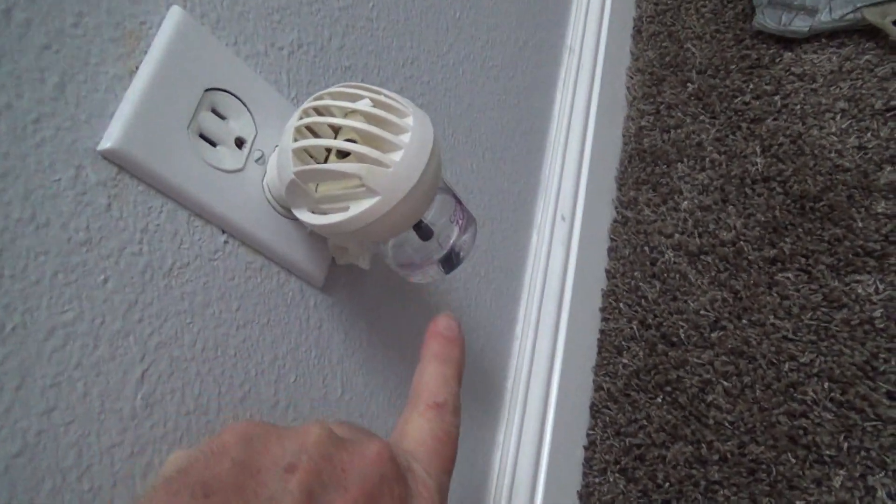The green screw is always for the ground. And on the back, it says 'white' — so I know which side is neutral. On lots of electrical outlets it even tells you right here for installation instructions, go to leviton.com/instructions.